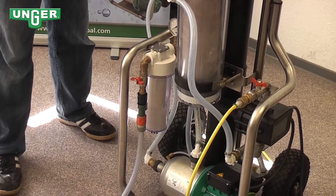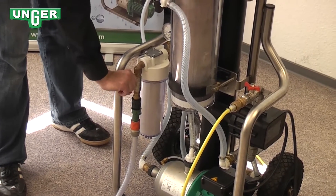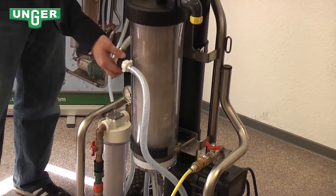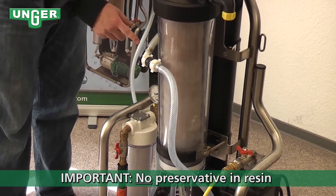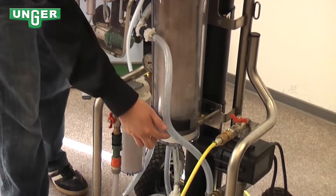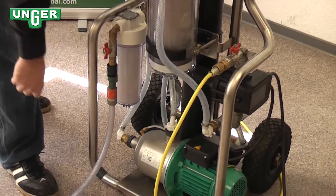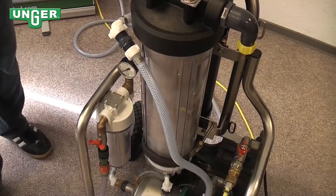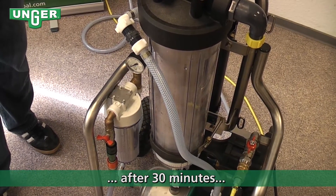When the machines are shipped, they're shipped in conservation mode. The first thing you need to do is turn this valve on, allowing the water to go through your pre-filter. It's going to come up through this hose, and this part is very important — this has to be connected because the conservation fluid is not allowed to go through the resin filter. After that, turn on your pure water side, which the hose is connected to go to your pole. After your system has been cleaned for 30 minutes, you can now attach the polishing filter on.